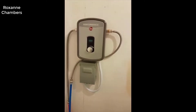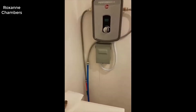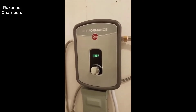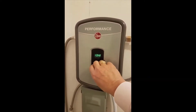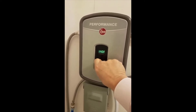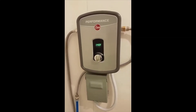The nice thing about it is they're super energy efficient. You're going to save a lot of money in energy, because with a tanked water heater you have to keep heating this big tank of water all the time — a 30 or 50 gallon tank of hot water, 24/7, 365. Whereas this one only runs when you're using the water. If you're not using water, it's using zero energy. It actually uses a lot of energy to keep 50 gallons of water heated to around 120 degrees, so you do save a lot of money on your utility bills with this thing.